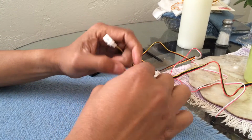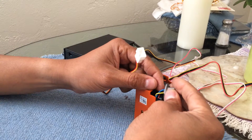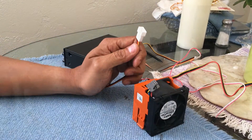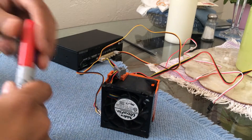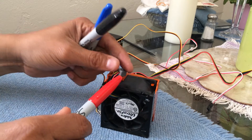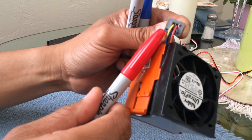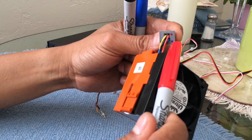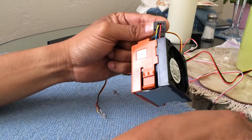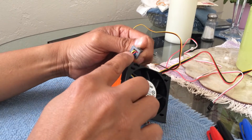I'm going to insert the pins inside this connector. This fan has four cables and this one has only three — that's the only thing you need. The blue one is just a sensor to the machine so it controls something else. Before taking the cables out, I just use a marker so I can identify the cables later: put red with red, black with black, and blue with blue. I don't have yellow so I only have those three colors.